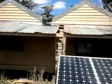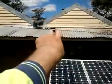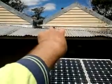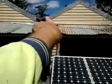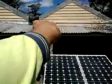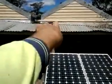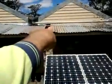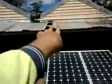But anyway, because I'm not too far off where the ridge is, I've got to make up just a little skinny one, and I'll have to cut one with an angle grinder or whatever to fit in there. I'm going to be able to lay more or less in the valley gutter and lean over and put the screws in there, and then rivet the last bits of flashings and silicon that as well, before I come back to this side and rivet the second screw in on the second batten, and of course I can do the end.